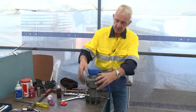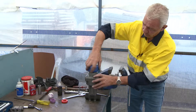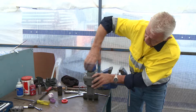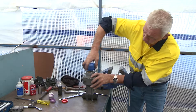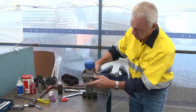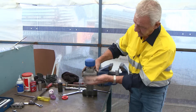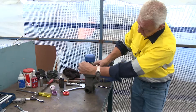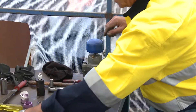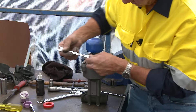You can see on the top of the valve here is this big blue knob. This big blue knob not only adjusts the amount of grit coming out, but there's something else here. Underneath this blue knob, I'm now exposing two breathers. When the piston comes up, it needs to exhaust somewhere because you've got excessive air — it has to go somewhere. As the piston raises, these exhaust ports here and here exhaust any air that's compressed or condensed within that environment. So what we do is take these off and check that we've got them clear and clean.